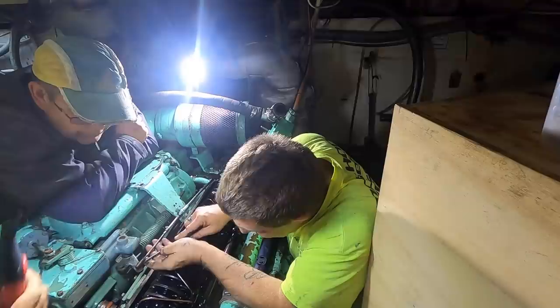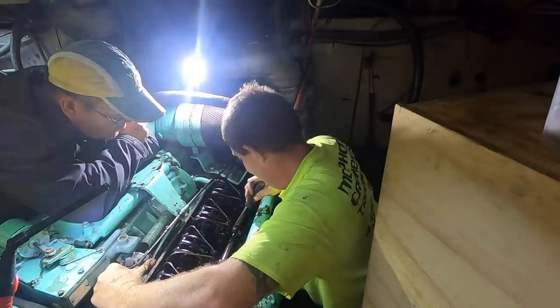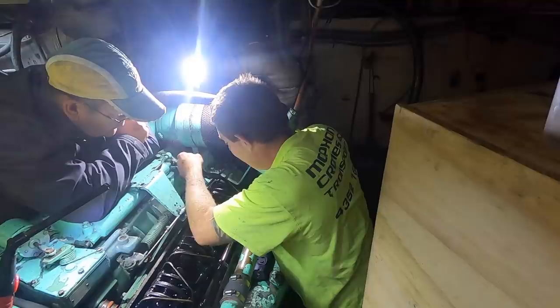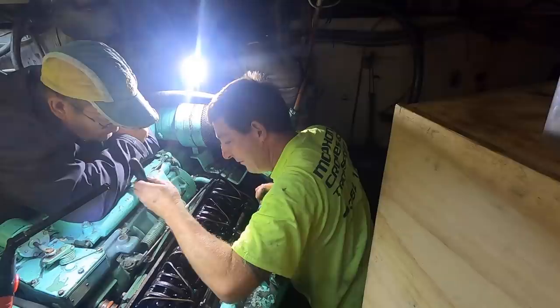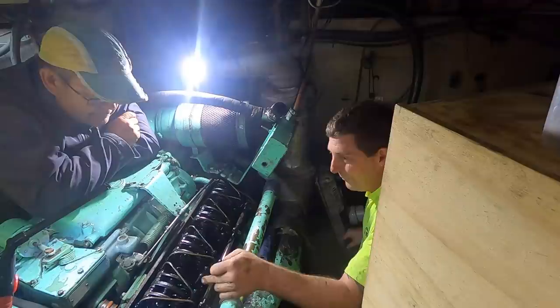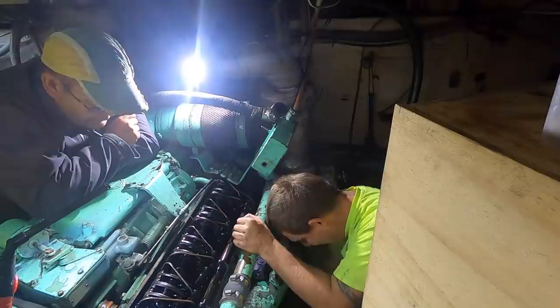We're just getting this little clip off here. Like little injector push rods — just the racks. Are they meant to be loose or tight? Should be tight. If they're loose, this one's getting dead hard full fuel; this one just a little bit — all the rest just a little bit off full fuel. It does make a difference at the end of the day.